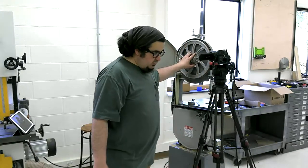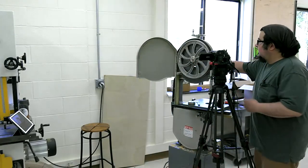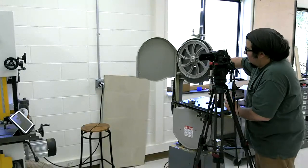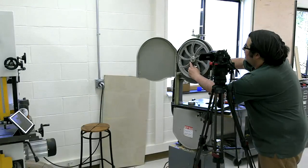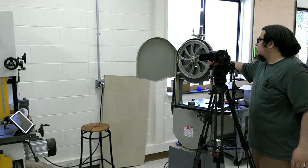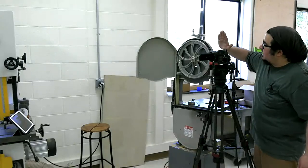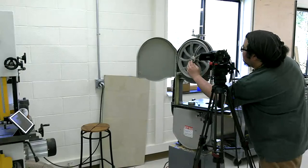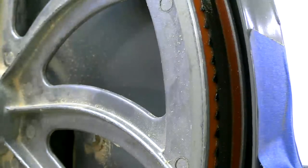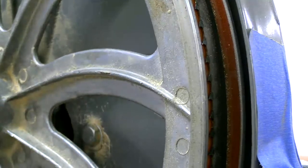So what I'm gonna do right now is come around here and not trip over cables. And I am going to mess up the tracking on this. And what I'm doing here is there's a knob on the back of here that is pushing on the bearing assembly and tilting this top blade. So look, did you see that move? Katie's saying yes. So I'm gonna go the other way with it. Oh, wrong way. So look, that blade is now coming over, it's cresting over.